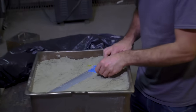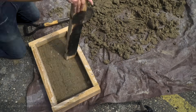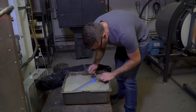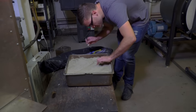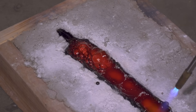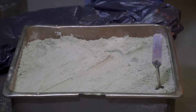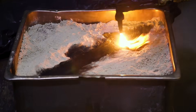Working with Fosai, I learned how sand casting for glass is done a slightly different way. Instead of packing the sand tightly around the mold, you lightly place the mold into the sand and pack it only along the edge. The idea is to allow air to escape through the sand so it doesn't bubble up through the glass like it did last time. They also torch the sand to leave a fine layer of carbon on top so the glass can better release from it.